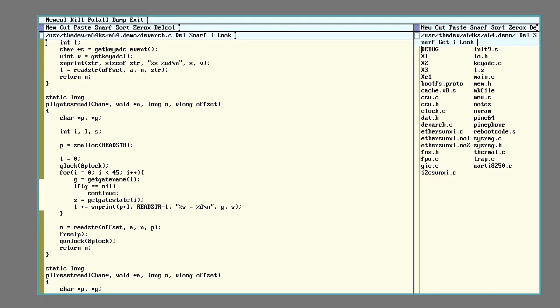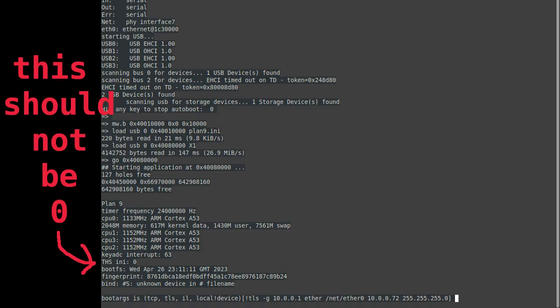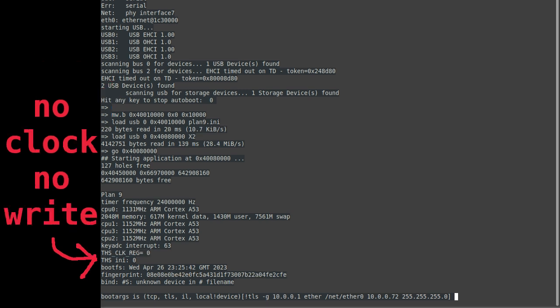Before we get into poking the temperature sensor, the first thing is to make sure that everything is turned on. Again, these ARM chips are often meant to go into portable equipment, so things are often turned off by default to save power. I already wrote some code that would read the clock gates and return a formatted list of what is turned on, and the THS sensor, which is the thermal sensor, was reported to be off.